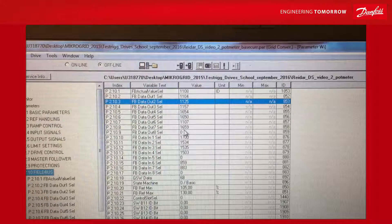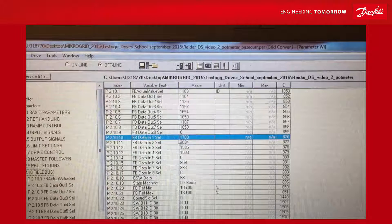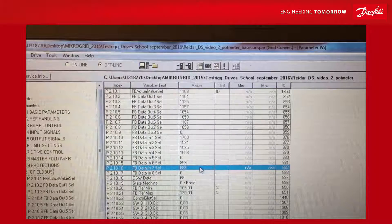In the opposite direction, references sent to the drive are configured similarly. A quite useful feature is being able to write any ID number and any value from the PLC to the drive, so you can change any parameter. From the PLC, you write a value into the ID number box — for example, ID 1533, which is the ID number for the base current reference. Anything the PLC then writes into the corresponding value box will end up in the base current reference on the drive.